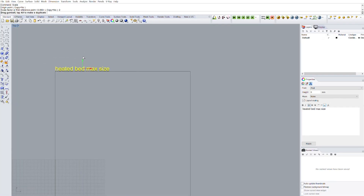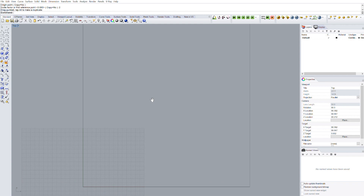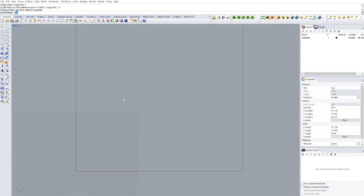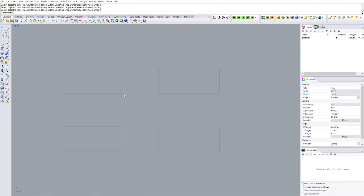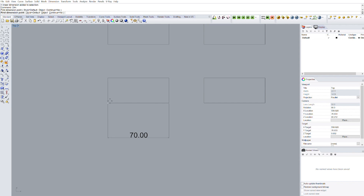We're going to start by drawing a square of 191 by 200 millimeters with the starting point at the origin. Making this design modular gives us the possibility to add more modules in the future. The modules will attach to each other with a snap fit at the bottom, which will make them more stable when attached to the whole structure. To start, I'm going to design a 2x2 array giving us four modules — these four modules are the same for now but we'll change them later.